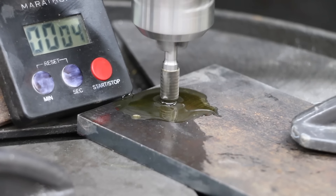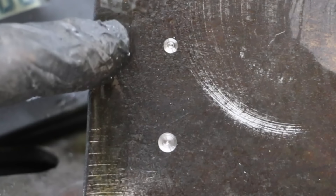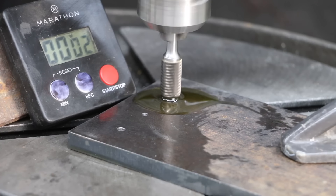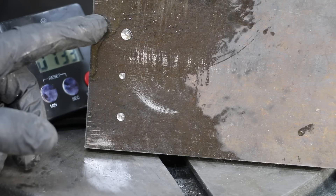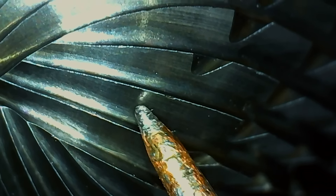Just like the Kangtier, the Ufuto is struggling to make a dent in the AR400, making a crater of only 3.71 millimeters. The tip of the burr experienced some dulling, and the Ufuto's tip just doesn't seem to be well designed for material removal. The Jestuis seems to be making a lot more progress than the Kangtier and Ufuto, taking the lead from the Kangtier at 6.02 millimeters, and held up a lot better with only minor wear and tear.